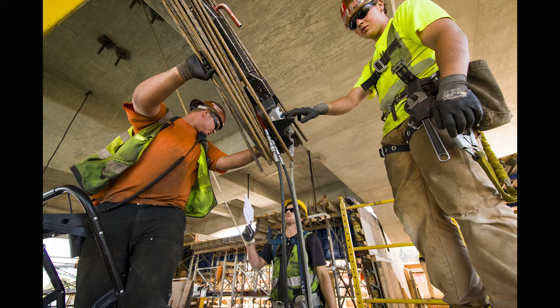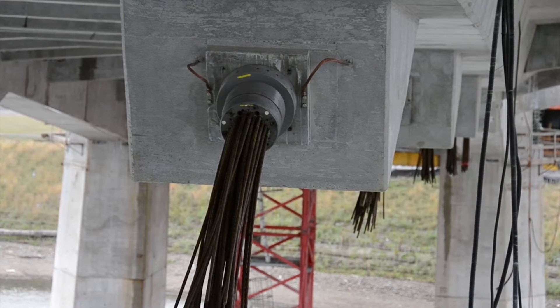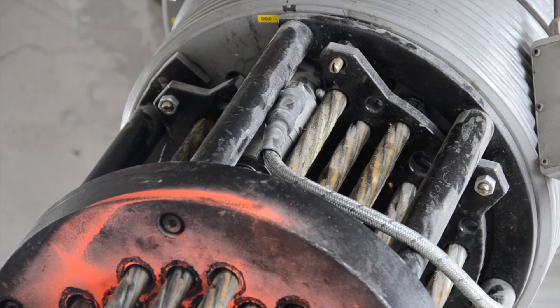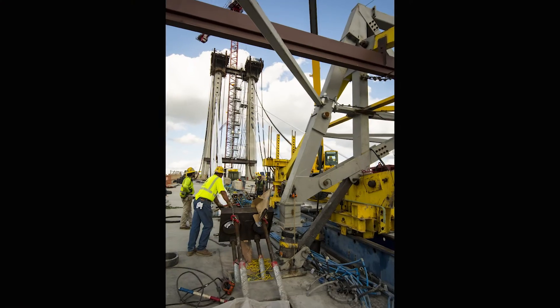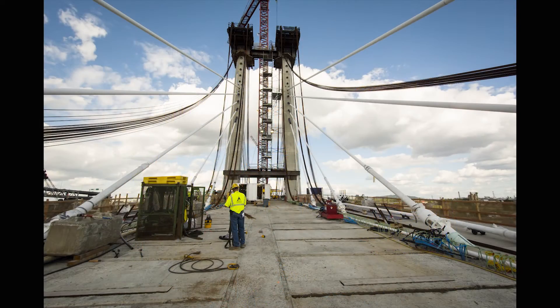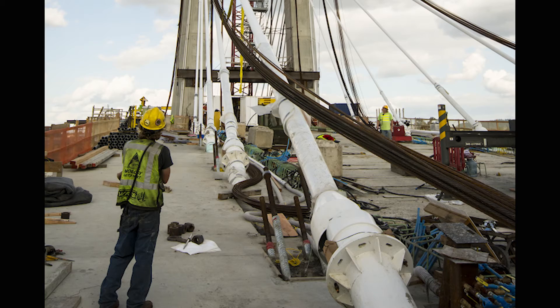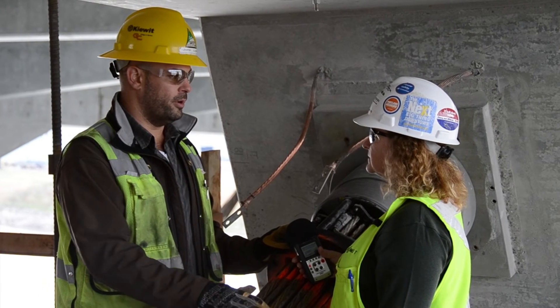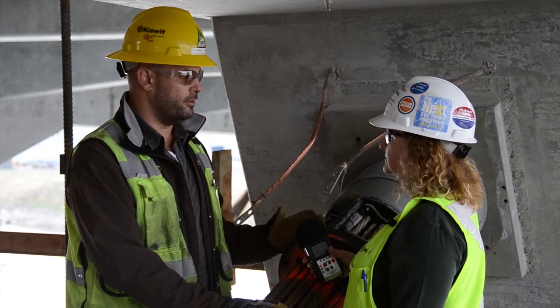After a single cable is stressed, do you need to stress it again? We stress them a few times during construction. We have our initial installation and stress, then the morning after the strands are all installed and stressed we survey the bridge deck to make sure it's somewhere close to where we want it, and we restress them one time. Then before the end of construction we will typically stress them again. If needed down the road 10–20 years, if the bridge starts to sag a little bit, we can pull on them and stress them again.